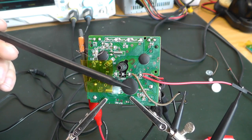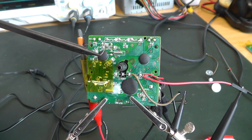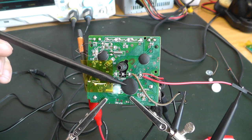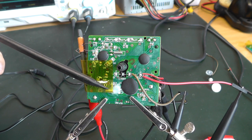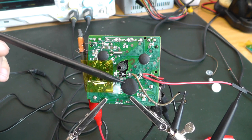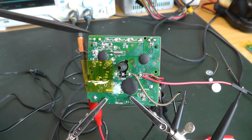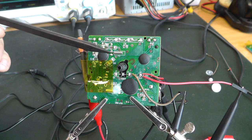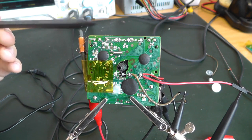The next integrated circuit is the central one - it controls the motors and it decodes the demodulated data from the RF chip. So the RF chip just demodulates the DCF77 signal, and this central chip decodes what data is transported on the signal. It also keeps track of time, which is why there's a small oscillator for the internal real-time clock. It decodes the time from the DCF signal, sets it on the minute and second hands, and for that it needs to know where the minutes and seconds are pointing.